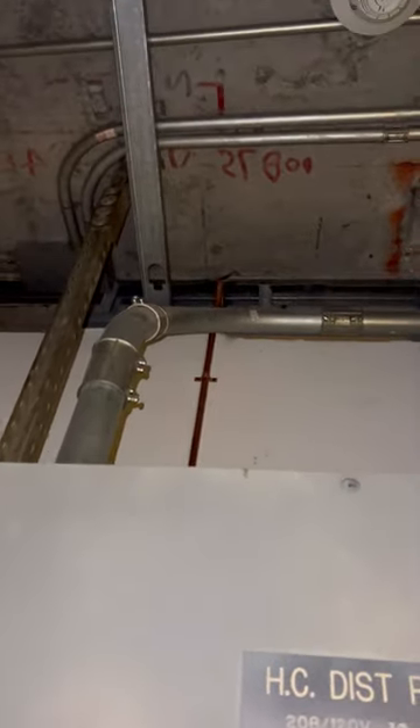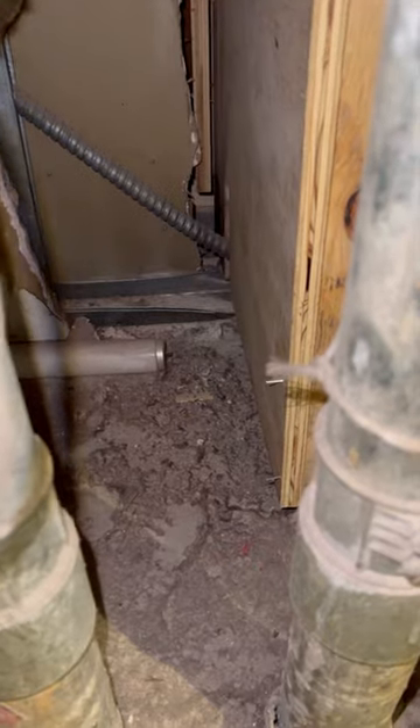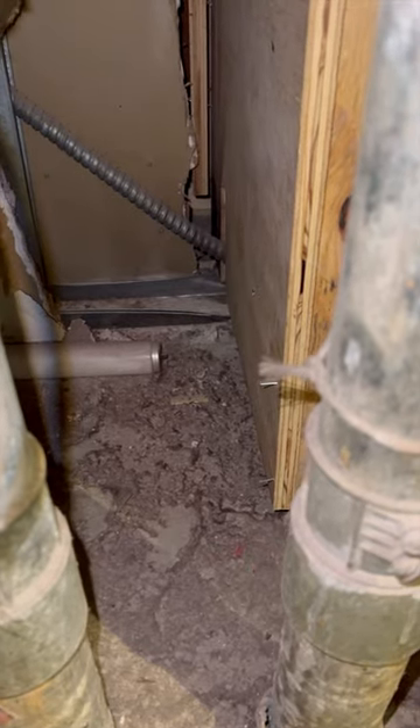Amazingly the C-line bathrooms were right above us, so I removed a ceiling tile to check and the risers were right there patiently waiting to be discovered. Thank god there was a drain valve on the cold water riser — that made the job a lot easier, because tapping into the 2-inch main would be a job for the press gun. When that comes out it means the proposal will reflect that and most clients tend to scare off.